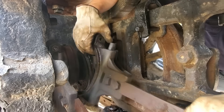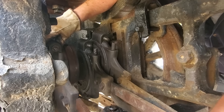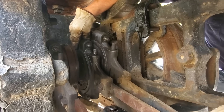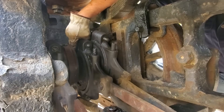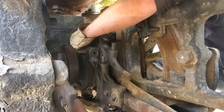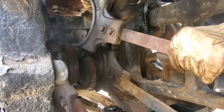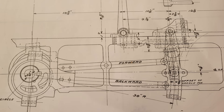This shot shows another interesting difference between the two locomotives — notice how the spring hangers don't have any shoes. Something to keep in mind regarding Stephenson link valve gear is whether or not the engine uses an open or crossed eccentric blade design. As you can see on the Davenport blueprint, the outside blade goes to the bottom of the link and the inside blade goes to the top, making a sideways V shape. If we were to flip things around and connect the outside blade to the top and the inside blade to the bottom, it would create a sideways X shape, otherwise known as crossed blades.